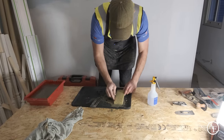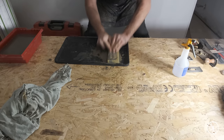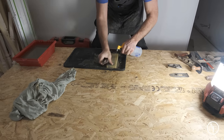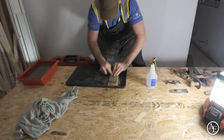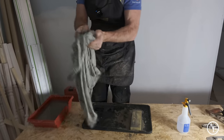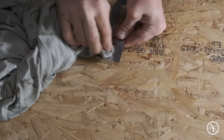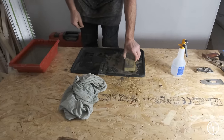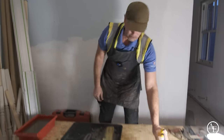Right, so quite happy with that. I'm now going to jump from my 4,000 to my 8,000. There we go — now this will really polish it up. Get those bits off, nice and flat. Look at that — there we go, that's like a mirror. Yeah, look — you can see, it's like a mirror. So I'm really happy with that edge. It's quite sharp now and I haven't even done the honing yet.